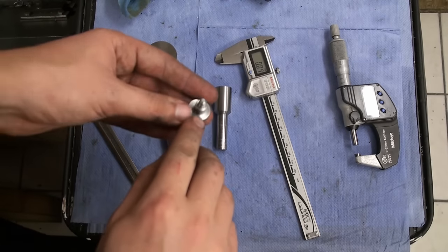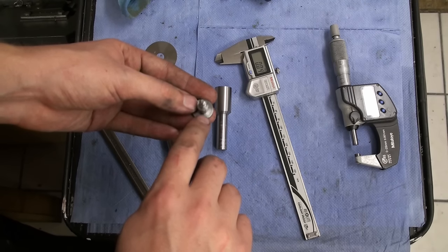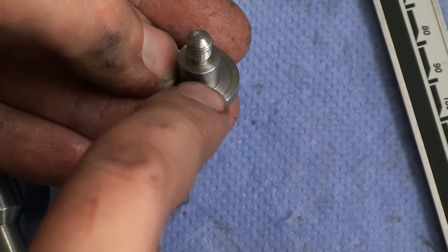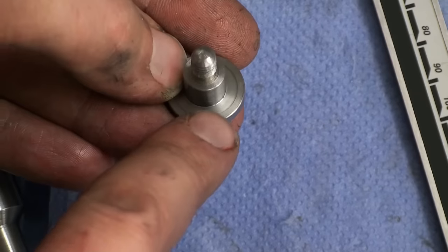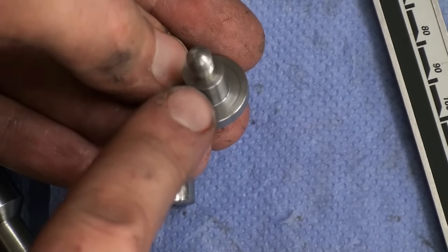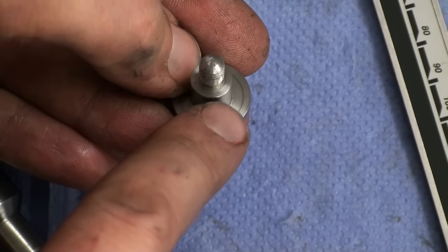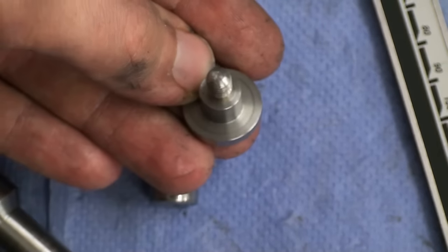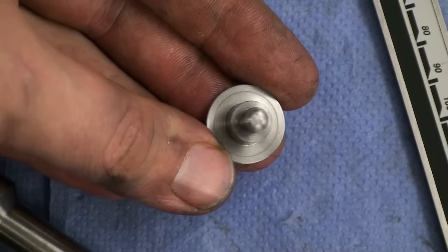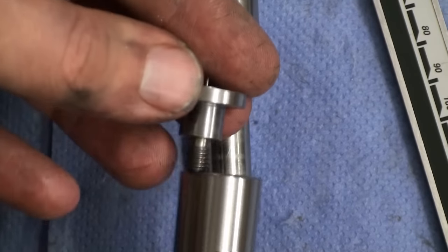And as with the arbors themselves, the bolt head is relieved on the inside. It's a bit hard to see on camera maybe, but you might be able to see that the inner area here is recessed back in. That has two reasons. One reason is that the lathe tool bit always has a little radius, and with the radius in the corner, the saw blade couldn't rest against the shoulder. And by relieving the inner, the screw only clamps on its outer diameter, and that gives a more firm grip on the saw blade. That's a proper way to do it. The thread is single pointed because I wanted it to run true with the bolt itself.